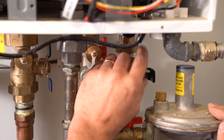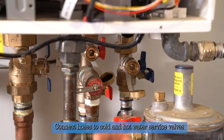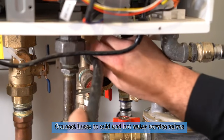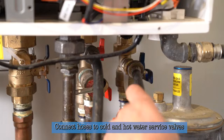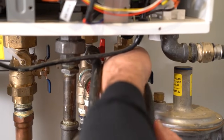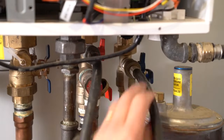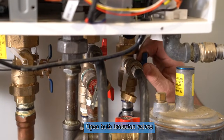I'm going to remove the cap on the cold water service valve and the cap on the hot water service valve also. Now I'm going to connect garden hoses to both sides. Hot is a little harder to get to so I'll do that one first. Just snug with your fingers is good enough — you don't have to crank these down with a wrench. It's the o-ring that makes the seal anyway. Now I'm going to put this in on the cold side, tighten it in, put the ends of the hoses in a bucket, and open the isolation valves to drain the heater.